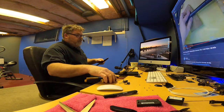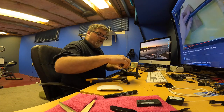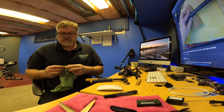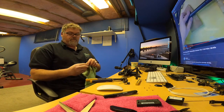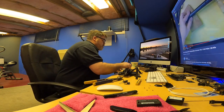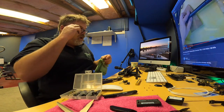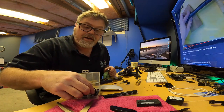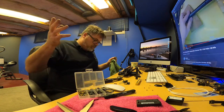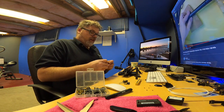Just pull on it — it'll come. Now we've got to get that out, which is inside the barrel, so that means I have to take all this back apart again. So this is the piece that holds the air, I guess. And I guess this comes apart somehow — threads, I guess. I can tell already that O-ring doesn't look too happy. Let's see if I've got an O-ring for this. I guess you can still buy this part if we need it, but I like to check things before I buy stuff. That O-ring definitely cocked over. I found an O-ring for it and I lost the goddamn O-ring before I had a chance to even get it in.